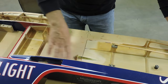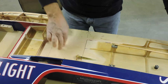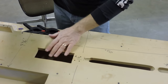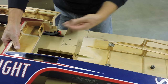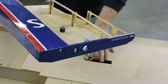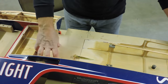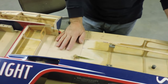A big issue: after I lay in the new floor and then the doubler that's going to sit in this forward area where the engine mount is, I've got to weight that really well, because what I'm essentially doing is laminating this upper piece to the bottom piece. I built a new floor section and you can see the jig has a cutout for the dropped engine well. If I set this on there and weighted it, I'd be sinking the floor down. No bueno. So I took a piece of quarter inch, cut the same shape as the original floor, left some room for the strut and the stuffing tube - and that's my new go-to surface. The new floor will lay right here, and then the doubler will go on eventually after a good portion of the framework's in, so I can weight it really well to get good adhesion between the upper and the lower.